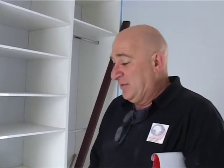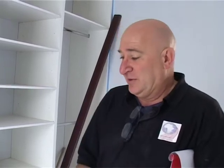I'll just tell you guys, with self-leveling screeds, if you buy the genuine self-leveler, that's exactly what it is. Now, when it comes to patchwork, it's not really a self-leveler, it's more of a patching screed. But on the self-leveler screed, you've got to mix according to the manufacturer's instructions. Exactly what the manufacturer says, that's what you need to do. Don't take shortcuts because it'll bite you in the back later. Every manufacturer has his own instructions. Go to the book.